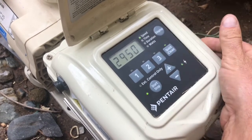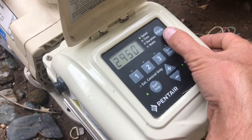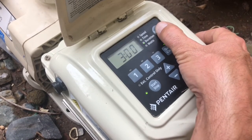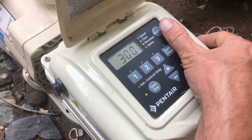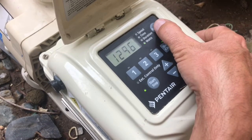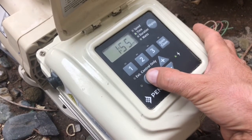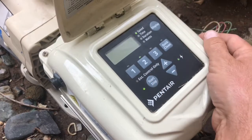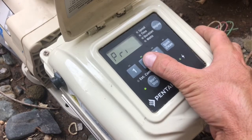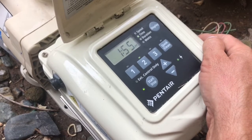A few other notes: the priming speed can be adjusted using the plus and minus arrows while the pump is priming. If the speed is adjusted below 1,700 RPM, priming mode will be disabled — this can be re-enabled by pressing the plus arrow at startup. Priming speed adjustments are saved instantly. If the pump has been stopped via the start-stop button, it will not run until it is turned back on — it's like a television. By pressing the start-stop button it will kick on, and if that LED is lit, you know the pump is operational. Pressing any of the speed buttons while the pump is running will act as a temporary override — it will run the speed and duration programmed for that speed button, and once completed it will default back to its appropriate point in the program schedule.